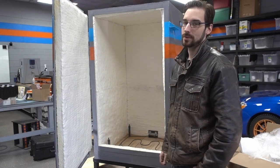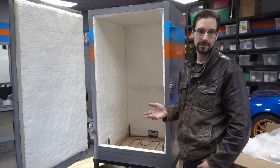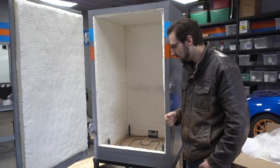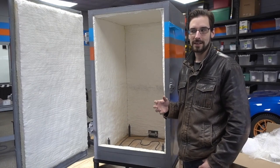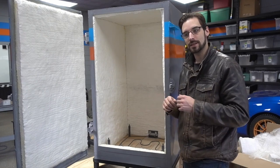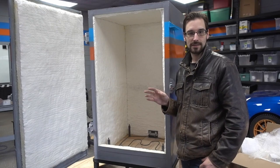It might crunch, but hopefully not — we'll see. You can see the element in here in its final position. I don't know much about the element; it's a 3.5 kilowatt oven element, but you can't really get specs on these — they're just replacement elements from Amazon. It's meant to handle 240 volts and 3.5 kilowatts, but if it gets really hot in here I don't know if we might break that thing or if it might melt. But if it does, I can always just remake the element using Kanthal or nichrome wire, which is just regular resistive wire — that's what people normally build their kilns and ovens out of.